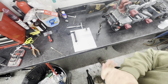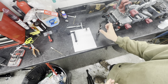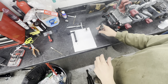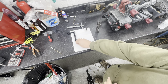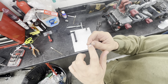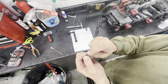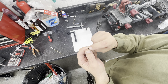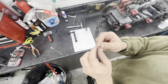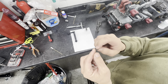This rifle looked pretty from the outside, but somebody put lipstick on a pig. For starters, they Loctited all the screws for the scope rail. I got all of them loose but one, and the last one I broke a high-quality Torx bit off in the screw. I had to come back through the action from the bottom side, drill a hole through the 6-32 screw to get the bit out, then heat it up just a little so I could remove the screw. That was the first challenge.